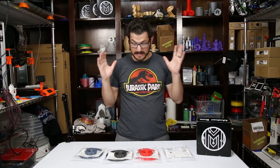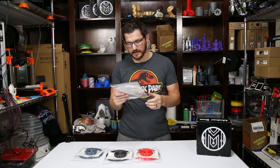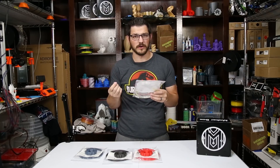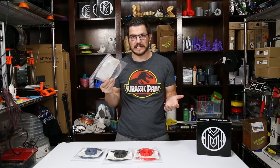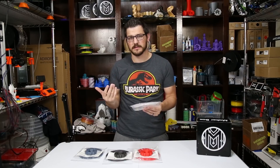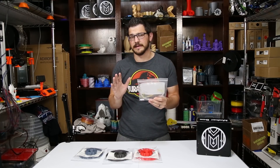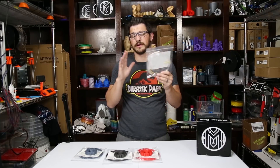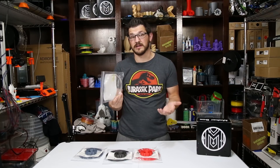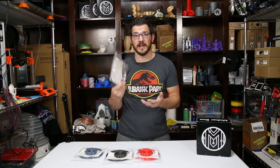Alright, the prints are in — three good ones, one didn't even happen. The PMMA by Dr. 3D Filament: this stuff is extremely hard — basically extruded acrylic. I had one semi-successful print but it came up off the bed. I thought it would stick to PEI, it did not. I tried glue stick, got three clogs in a row, just kept clogging. I went through probably more than half the sample, and even if the clogs hadn't happened, I probably wouldn't have gotten a full MakerCoin print regardless.